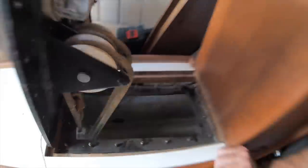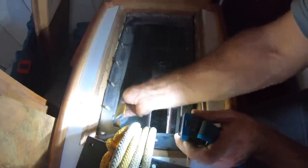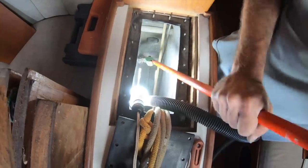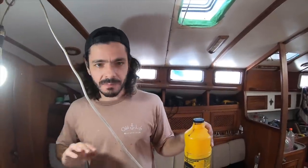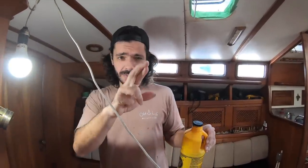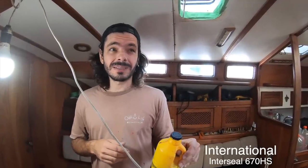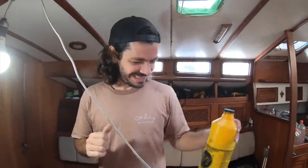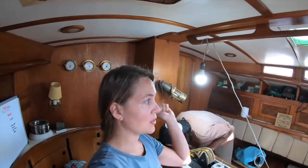That's the centerboard trunk — you can check. We're just opening to see if it helps to paint from the top, because this part is gonna be a lot easier to work from here. The plan is to apply rust converter, because some spots it's impossible to remove 100% of the rust, so we're gonna convert the rust and hope for the best. We're gonna apply this first, wait a little bit, apply it again, and then apply Interseal 678D from International — hopefully two or three coats, and then we're ready to start bottom paint. Before this, we actually tried to sand this with a lot of different tools, and yesterday they used a pressure washer in here and now it's pretty clean to start working on it.